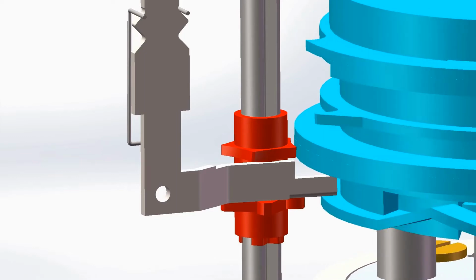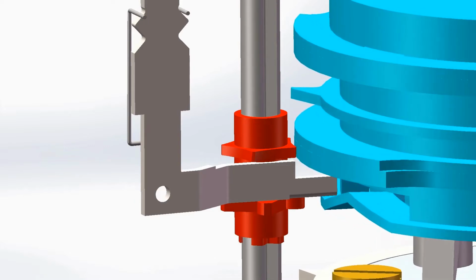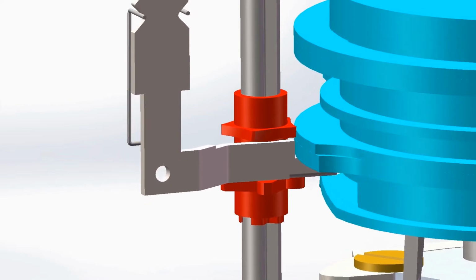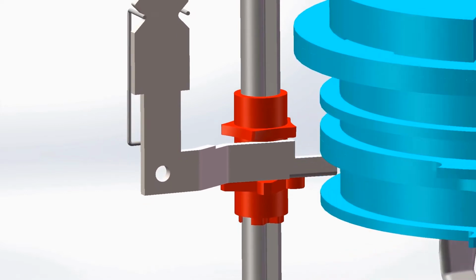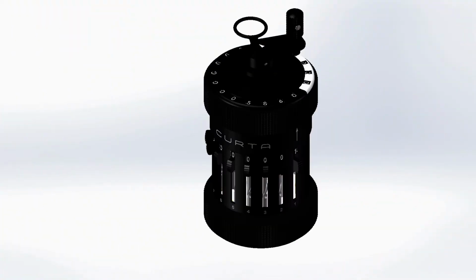On the next turn of the crank, the carry lever is restored to its upper position by the upward sloping protrusion on the carry increment disc, moving any previously lowered count gears out of the path of the disc's tooth for the following turn, until they are activated by the carry pins again.